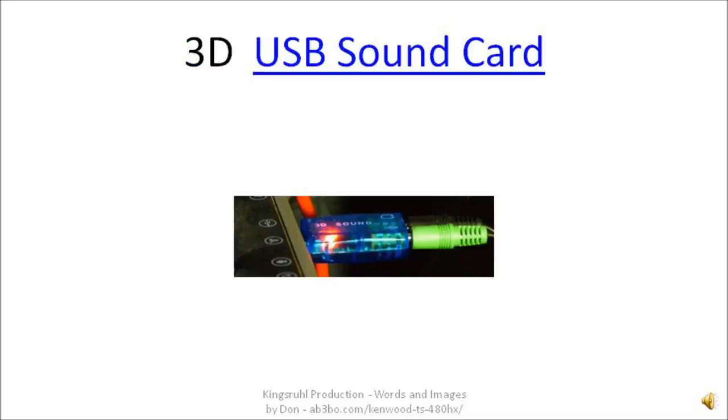This is a 3D USB sound card. You can see the two audio lines that come in on the right hand side of this image — those are the input and output for the data lines of the radio. The 3D sound card connects up to the USB port on a notebook computer. I use the sound card this way because it supplies a little more isolation between the radio and the computer, and it frees up the headphone jack and microphone jack on the computer for regular use.